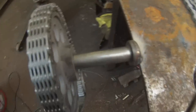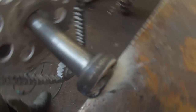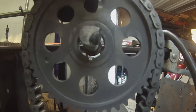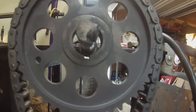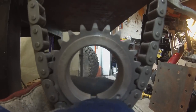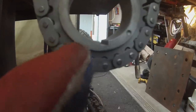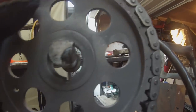Okay, so when I'm making these timing chain clocks, this is kind of my setup. I'll take just whatever round rod I can find — this one I used one of the nelson studs I have, kind of welded it to the edge of my table. Put a little timing chain cog through the gear set through the rod there. How I like it — I like the keyway there on the downside. Try and match it with the keyway on the bottom there, and then I'll just kind of tack weld it in a few spots — tack weld the bottom in a few spots. Usually do the three, nine, and six, do a little bit more on the top gear set.